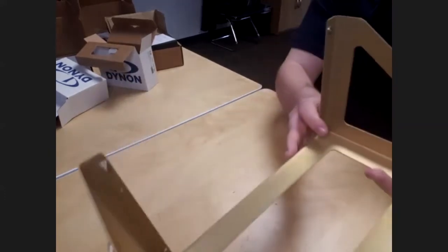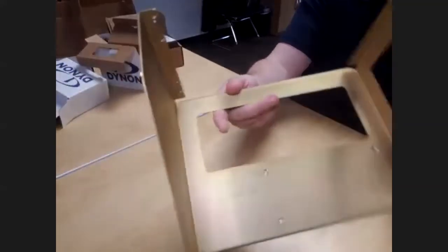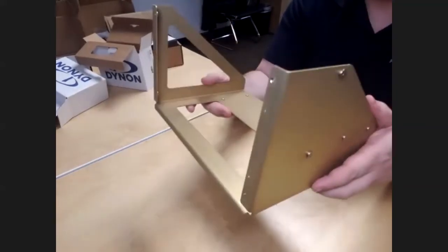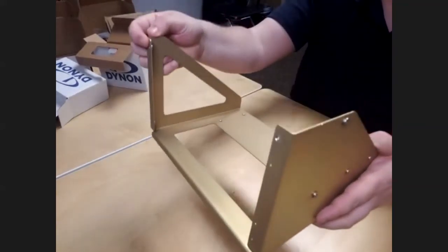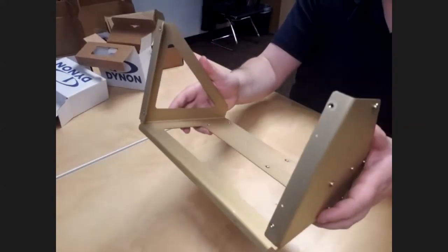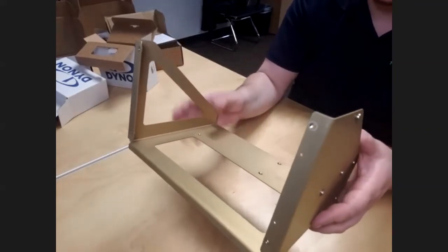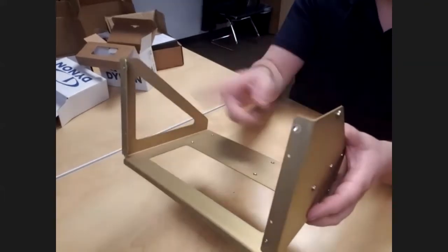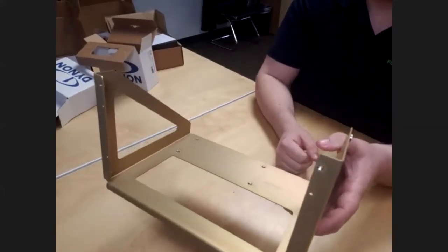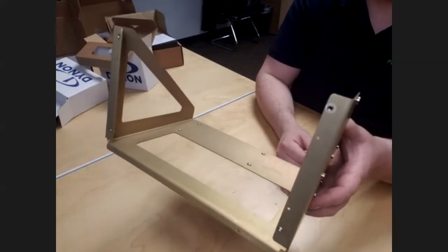These do also have PEM nuts already in place for the HDX mounting positions. So this bracket would be physically riveted to your actual panel. And then these threaded holes are what you thread the screws into for the HDX. So this bracket and your HDX sandwich the instrument panel material itself. Among other things, that makes for pretty easy service access. Four screws, slide the display out a little bit, and now you can reach parts and pieces back here if you need to unplug stuff. You don't necessarily have to pull the whole panel out to get a part out if it needs service or replacement.